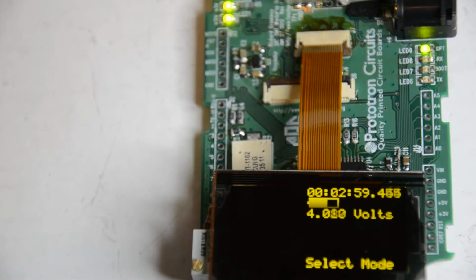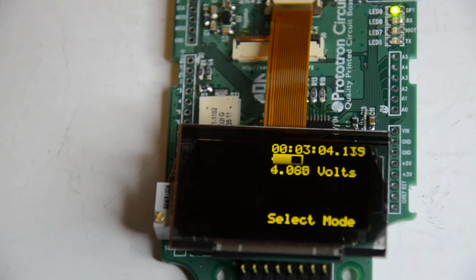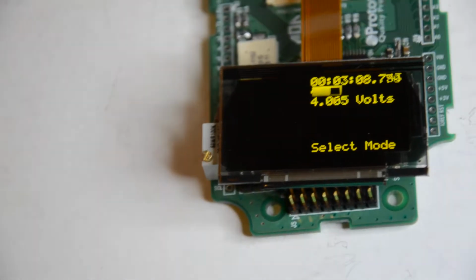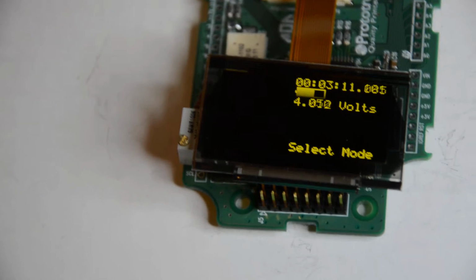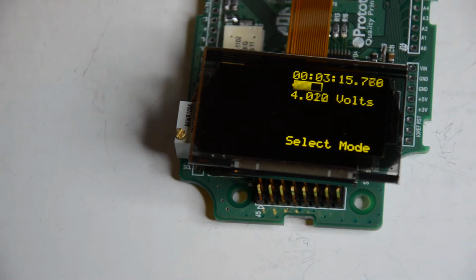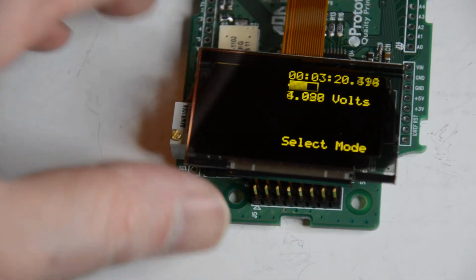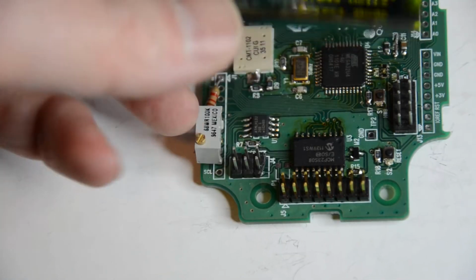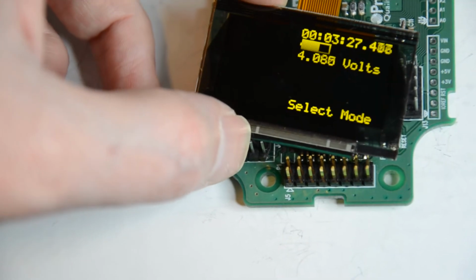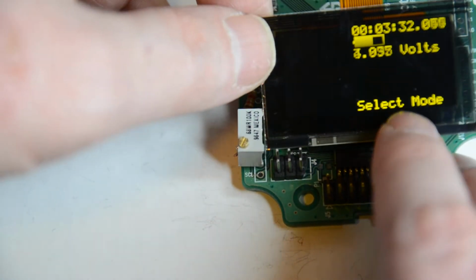You can see I actually do have both the monochrome and color OLED headers on this board. You can obviously only use one at a time, since they both use the same chip select line for the SPI port. And you can see buried under here is another pin header, and that's for that SPI port expander for just a standard character LCD, which you could use at the same time as any of the OLEDs, or you could use it as additional I/O or just on its own.